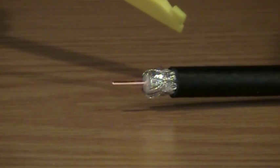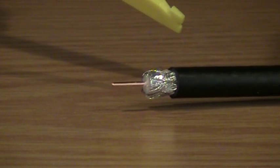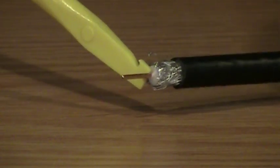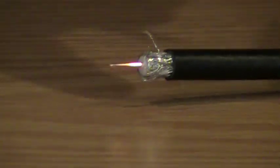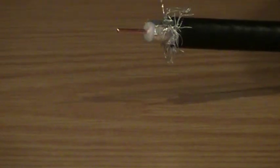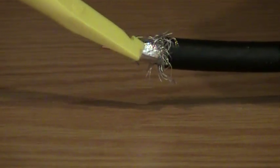RG-6 center conductor is going to be usually 18 gauge. RG-59 is usually a 20 or maybe 22 gauge, and usually has more loss because the conductor is smaller. This is copper-coated steel, as discussed in part one. Then we have the white dielectric underneath that, and on the outside an outer jacket. When we remove that outer jacket, it exposes the second conductor, which is the braiding — and you can get that in all types of different materials, covering typically 60% or 40% braid.